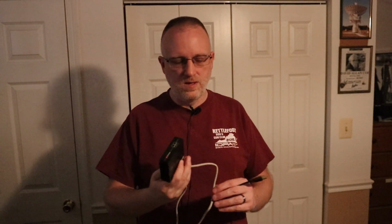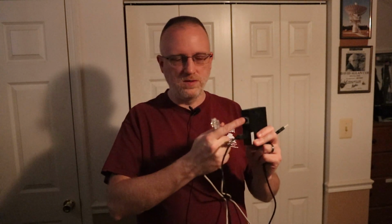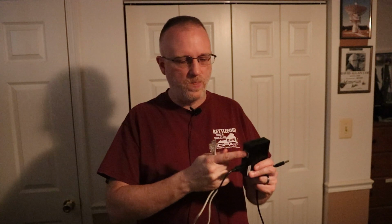We refer to Cat5 synonymously with Ethernet cables, and in this particular case, we're not. Cat5 is a cabling standard, and Cat5 cable and Ethernet cable are usually transposed in conversation. The AV Access has decided to use an RJ45 port with Ethernet cabling, but their own signaling to get the communications between the two units.